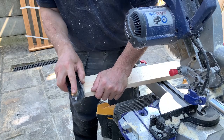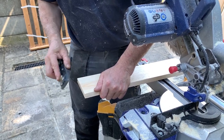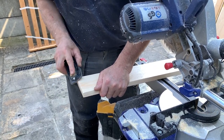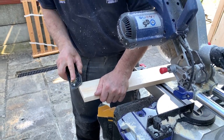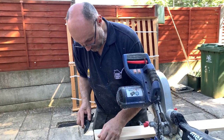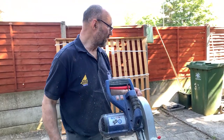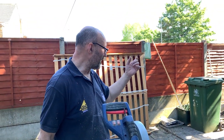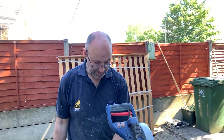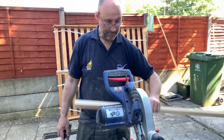This is a 4-5 chamfer that I spoke of earlier. The idea of this is we're just going to use this to throw the rainwater off the front of the door. These are actually going to have to be planed down thinner as well, because this is all standard stock timber. The dimensions of the job we've done haven't worked out quite right, and this wood will stick proud of the door, so we'll have to reduce the thickness to make sure that these faces are level. That will be a later stage, but there we go, we've got a nice chamfer on that one.